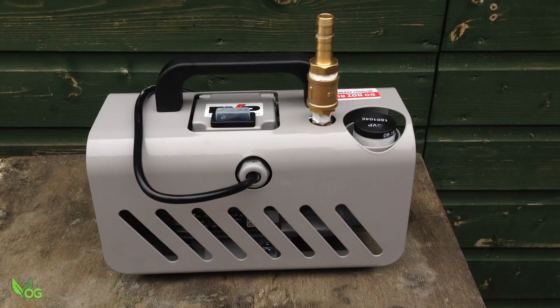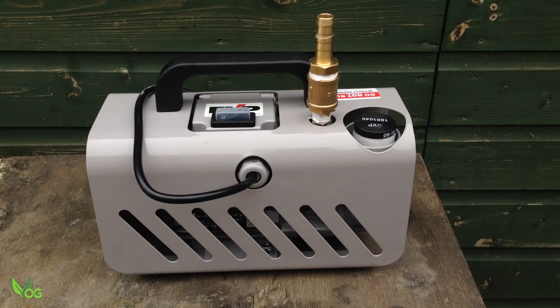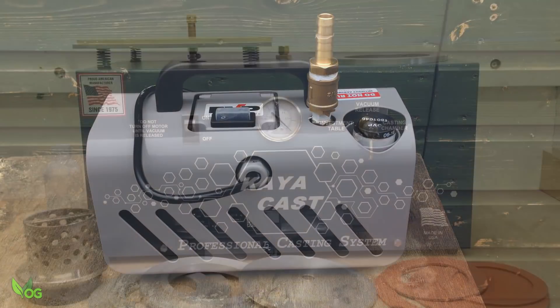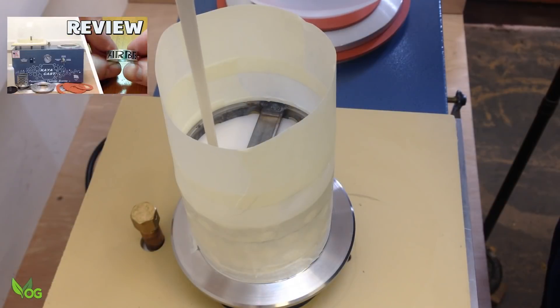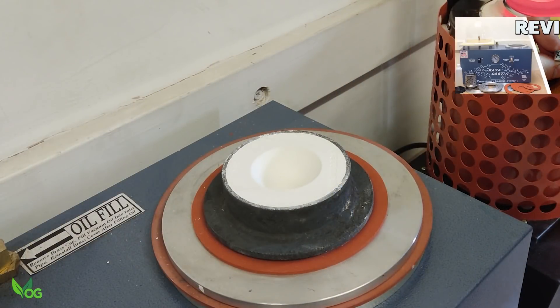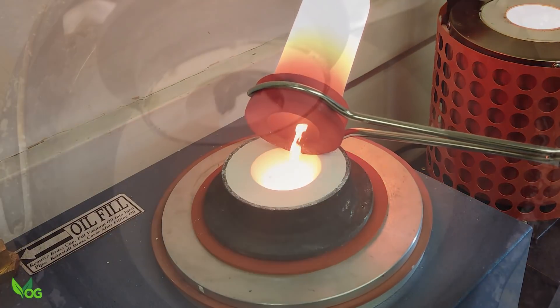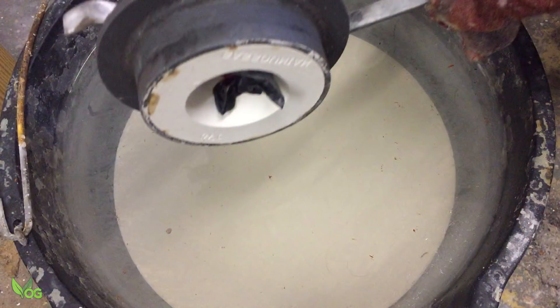My pump states that it should not be used on anything hot, but I've used it dozens of occasions with a long hose without incident. But do this at your own risk, as these are expensive things to break. Something like the RB system is a much better choice and does the job faultlessly, though it will cost you that bit more. Plunge the flask into a bucket of water a few seconds after the red glow has gone from the visible metal.